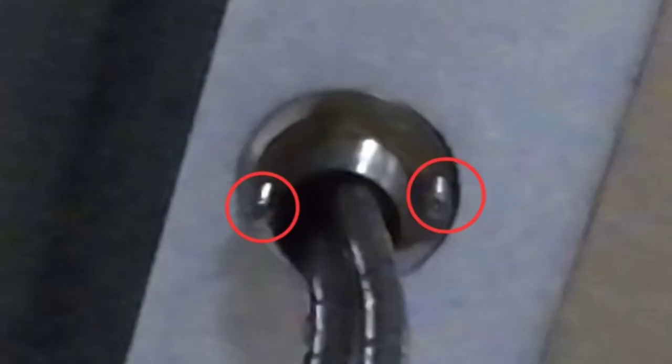Now there's a nut on the bottom of this with two screws on it. Get my shaky hands in there and you just loosen these two screws up — these screws are what actually tightens everything down. You loosen those two up and then you loosen up the nut, take that all the way off. Then you want to remove one supply line at a time to get through this nut. Let's go back up top and yank it on out.